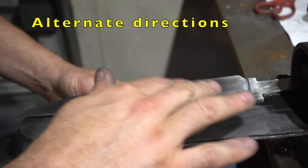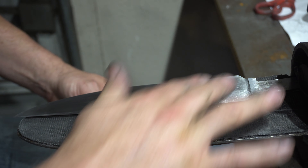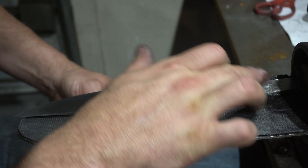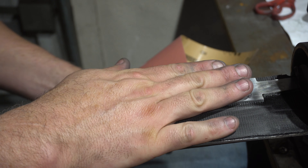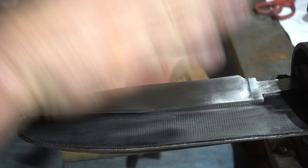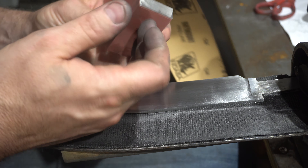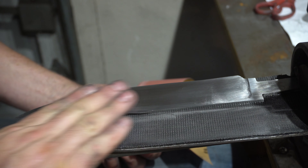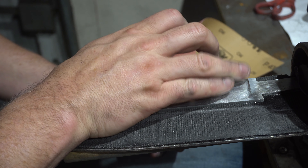So that's a 220. Now I'm gonna go at 45s — many have probably heard this — you want to go at 45 degrees because that'll really show up the lines from the last grit. I'll go 45s and even go 45s the opposite direction on the flats as well. I'm looking for just to get out all of those scratches, and I'm doing this with a hard backer. I'm taking this blade up to 400, then I'll go all the way up to 800 and do straight lines at 800, then come back at the end with a leather backer and do single strokes to bring it back down to 400. That should give us a really nice finish. Also, doing 45s into the plunge really cleans up the plunge area right here.